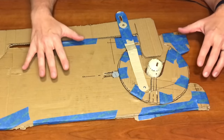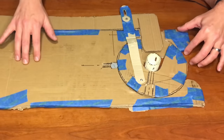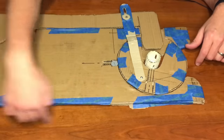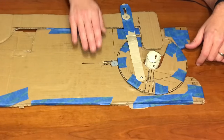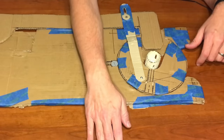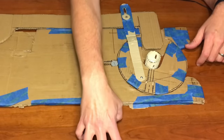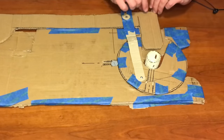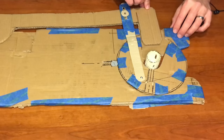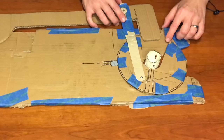Now this guy is going to lift up. Once it gets to the very top, there is a cam underneath on the track that's mounted down here in this area. And this hammer has another arm that sits down below that and simply rides on that cam. As the wheel finds the cam, the wheel pushes the hammer up. As the hammer starts to rise and come away from there, it gets up a little bit and starts pulling on this arm assembly at the same time.